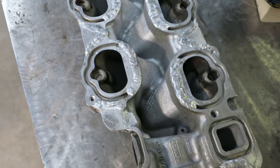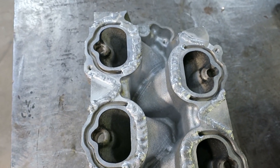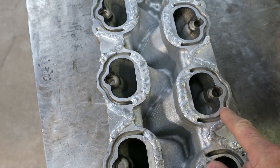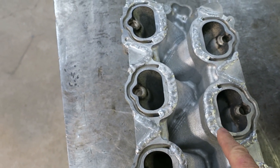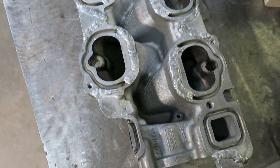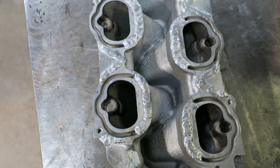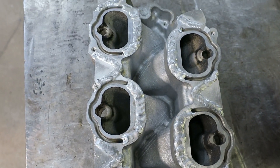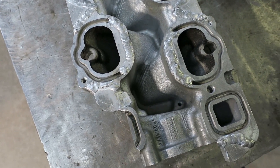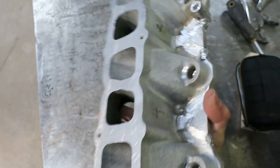I've got those inserts all welded into the head to remachine the bolt pattern. Also, the packings that go in these grooves here to seal the manifold to the cylinder heads weren't going to line up properly on the cylinder head, so I filled in those grooves with weld and we'll have to machine it back. There's a lot of junk in the casting still — dirt, oils from service, or other debris — so the welds aren't perfect, but they'll be okay. I've already started blending the welds on the other side.